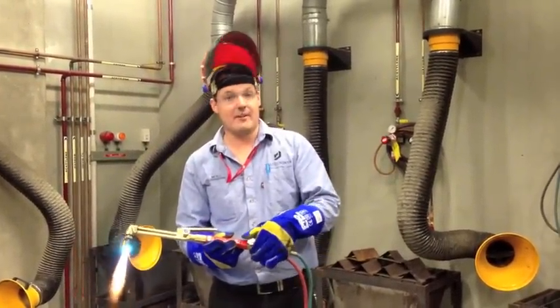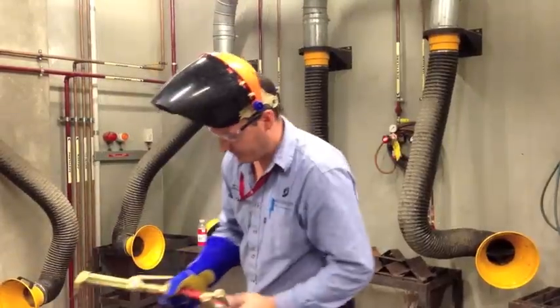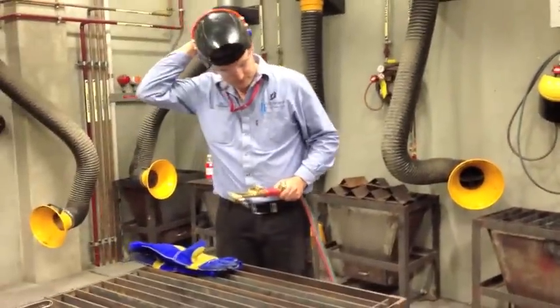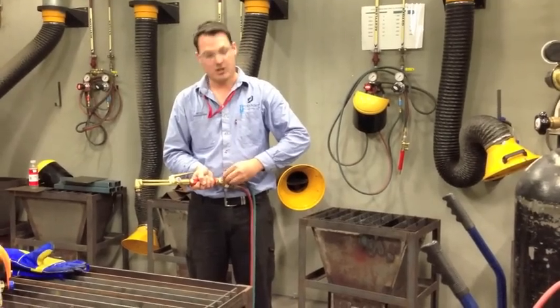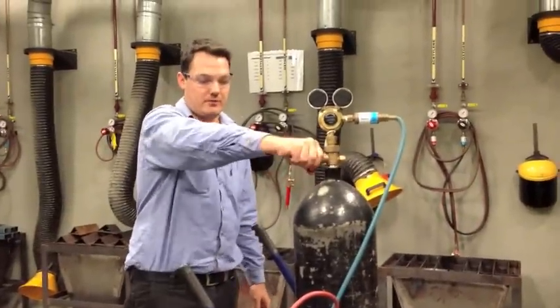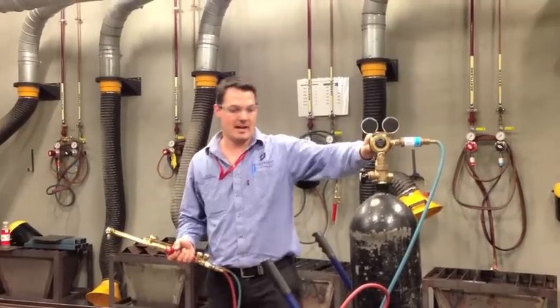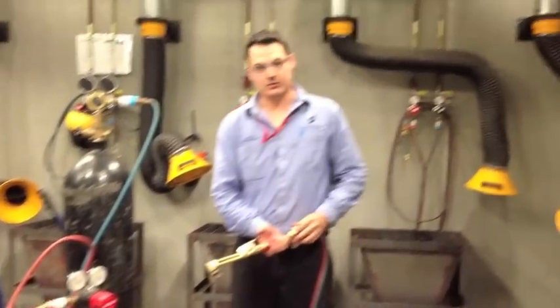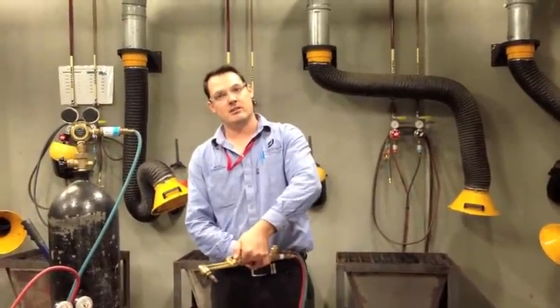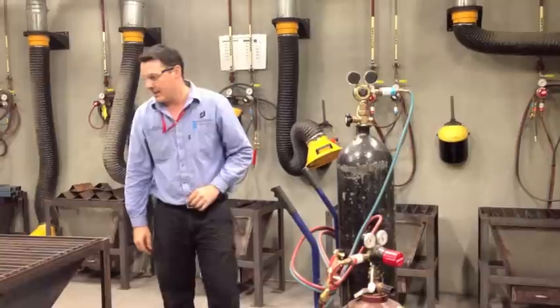Turn off the oxygen lever, then turn off the fuel gas first. We can now remove our PPE. Release all the gas and turn off your back oxygen lever again. We're going to knock off the bottles at their main valves — nice and tight, turn off. We're also going to release the pressure in the regulators, all the way back — oxygen and the acetylene. Once they're backed off, we can turn on the oxygen and you'll hear that pressure be relieved from the line, and also with the acetylene. Those bottles and lines are now free from gas.